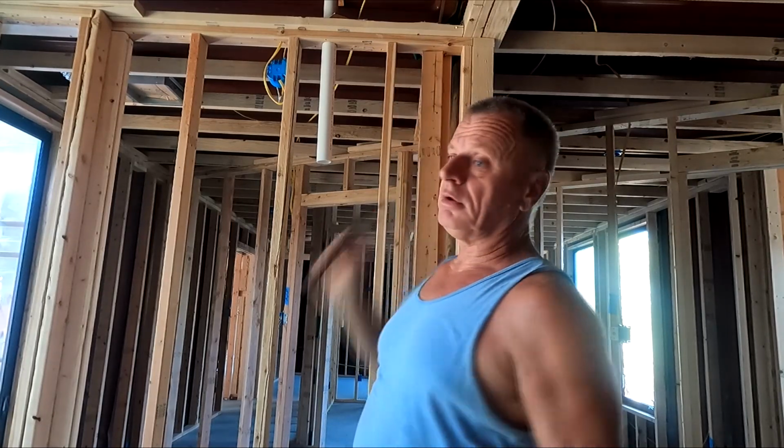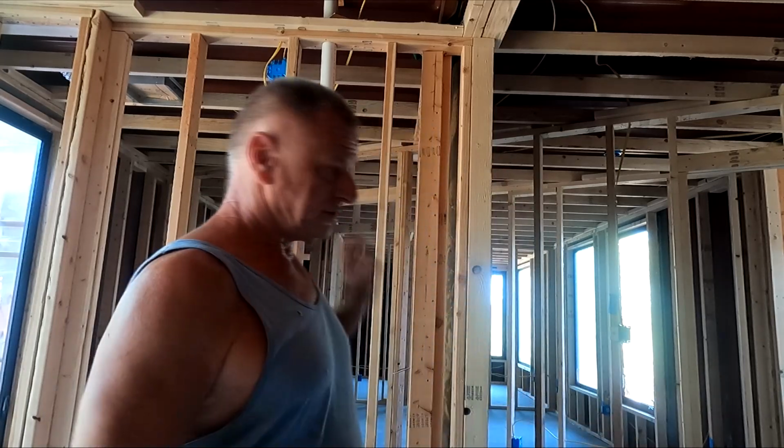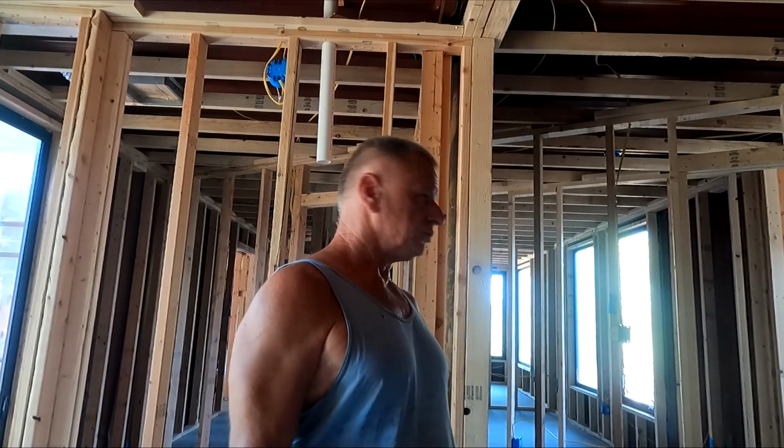So today's work, this is September 17th. We're going to start doing the roughing for the sinks for the bathrooms. I did all the wet pipe underneath, and then the vents up there. Finished those up. They're going through the roof already, so we're good there. I'm just going to connect everything there. The fun part's going to be the master bath, because I have two sinks. Got all the P-traps, got to figure out where they actually go. Obviously it'll span maybe 3-4 feet apart. Two rough ends there, and then they join in the middle for the actual wet pipe drain.